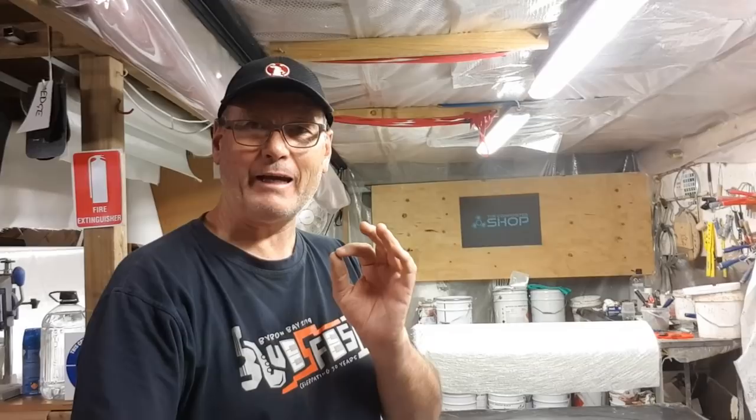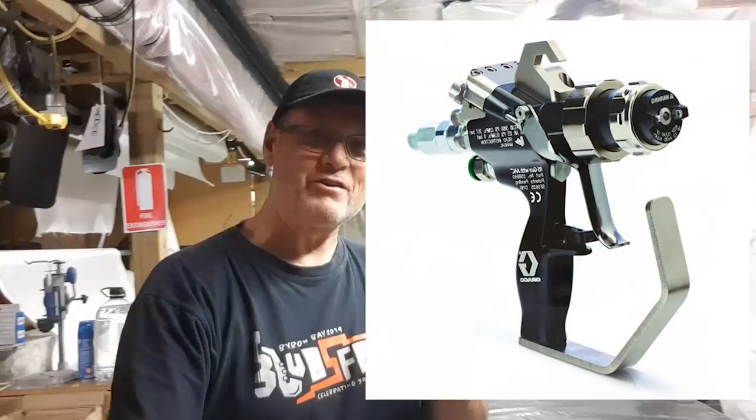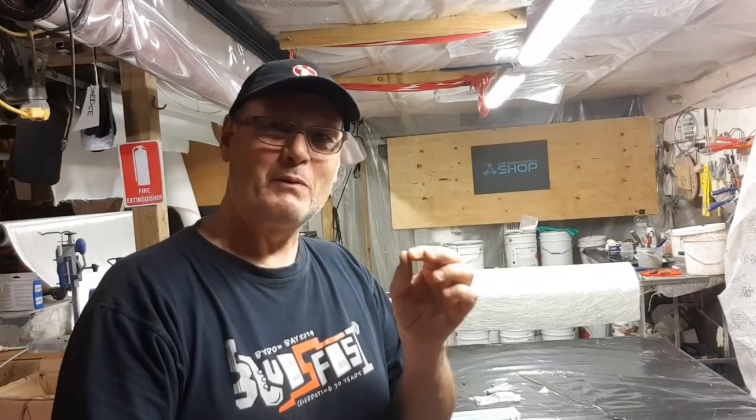I've been in a world of trouble the last few days laminating. I've had an air leak in the back of my Graco gun. It transpires the leak is in the aerosol assist for the catalyst. As a result, I've had a couple of spots where my catalyst hasn't been exactly right, and occasionally that little tube pops out of the air fitting and I won't have any catalyst at all — ending up with a big blue spot where I'd otherwise have a catalyzed piece of resin.